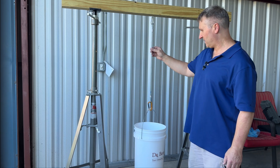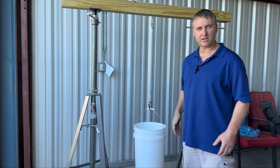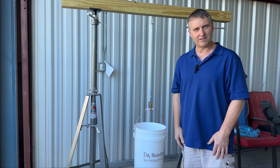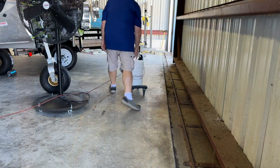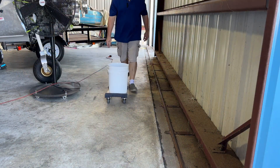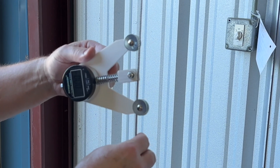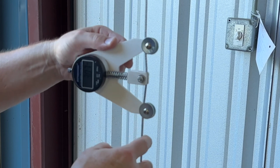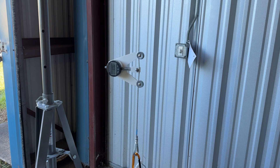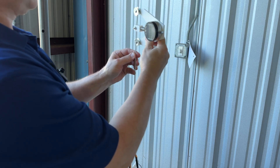This is how I'm going to calibrate my tensionometer. I have a piece of eighth-inch cable on these loops on both sides. I'm going to fill this bucket with different increments of water — like 5, 10, 15, 20 pounds. I have a scale over here. I'm going to measure the bucket as I keep putting water in it and see what my dial reading indicates at each 5, 10, 15-pound increment. First test — this is at 10 pounds. Put one wheel right there, the other one right up there, push, and see what the reading is. At 10 pounds, first reading is 3 millimeters. We're going to record that at 10 pounds. I may get rid of the highest and lowest, average the other two, and call that my 10-pound mark. Then put 15 pounds next and go up like that.